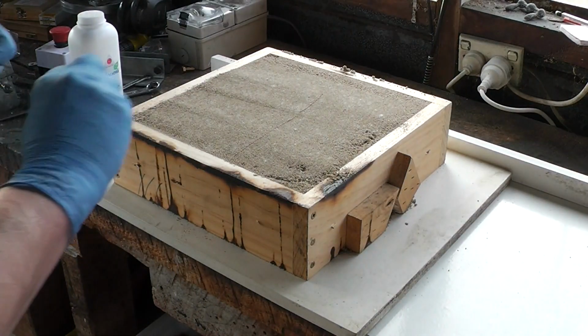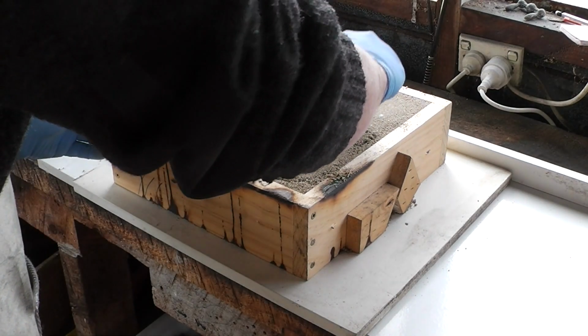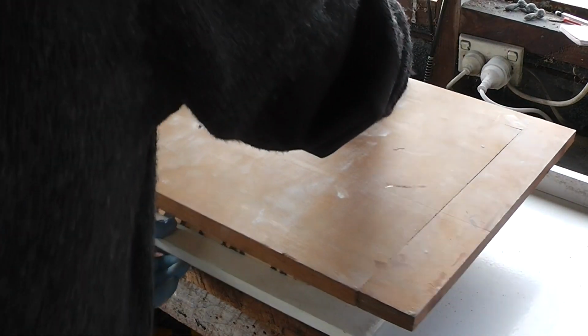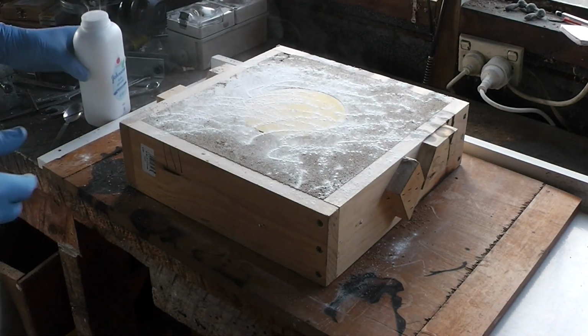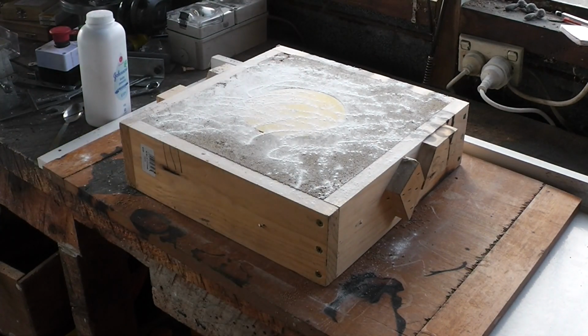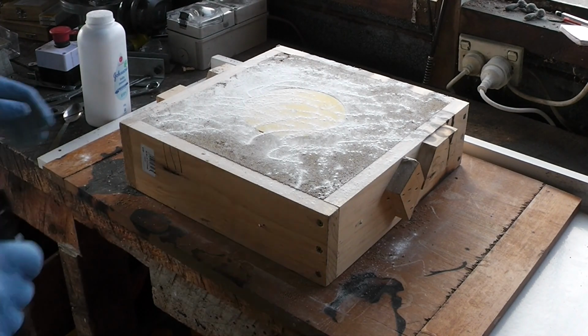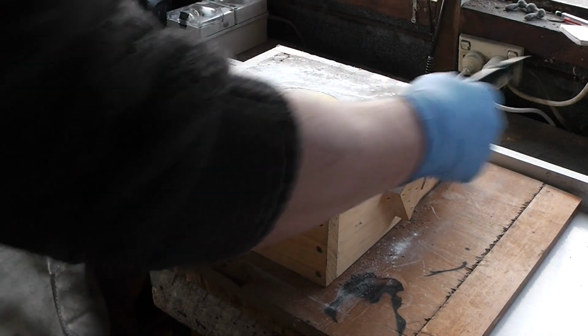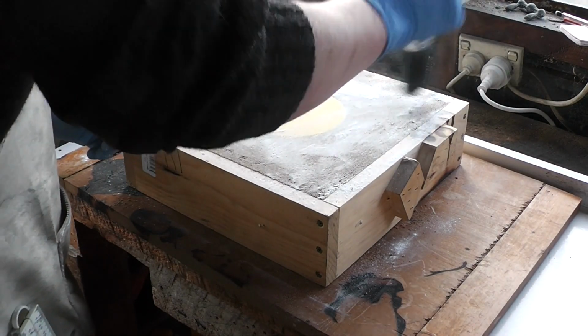Alright, before I forget, put some vents in. And roll it over. I didn't put any shellac on this pattern, but on the other hand I put a lot of draft on. So I'm hoping that lots of draft will make up for the layer lines. Plus I'm going to be machining it down anyway, so I'm not hugely worried about the finish.